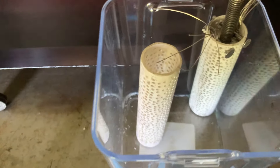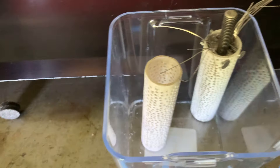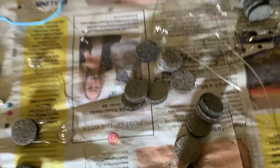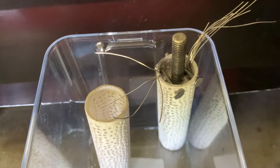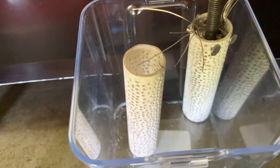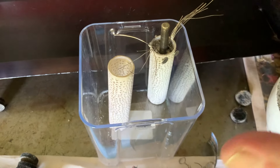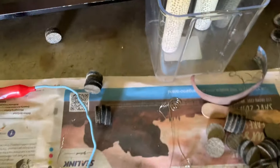I'm using nails as pins to hold the retainer back so I can compress it, because we don't need a lot of compression. You don't want to really crush the felt — you just want to make enough contact to the wire and the nickel hydroxide. A few taps. Each layer has 0.5 grams of nickel hydroxide. Once I pegged it and compressed it a bit, compressed down to about this much. It seems to be firm. I tapped it and 1.3 grams of nickel hydroxide actually came out of the whole cell for spillage.